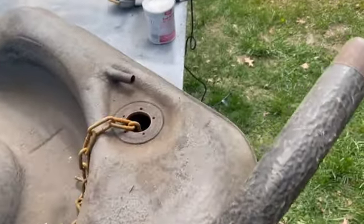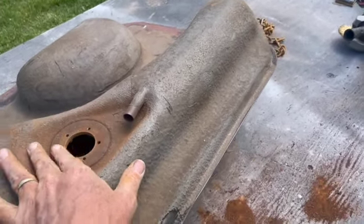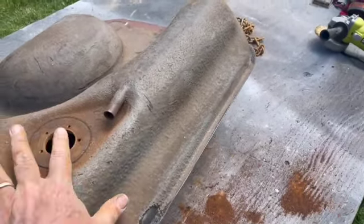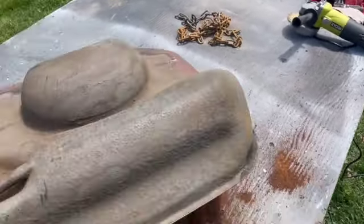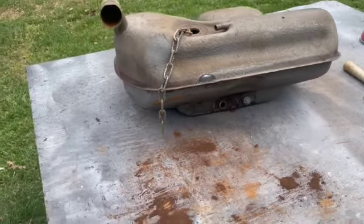We're not stopping every time, but this is the kind of stuff we're getting out. Using the vacuum cleaner too — trying to break up and get all that loose material out. I know a lot of you are thinking why not just use the power washer, but it takes forever for them to dry. I want to get the scale, get all the loose stuff on the inner walls knocked off first before we ever start rinsing. Whether we use CLR or muriatic acid, we'll pre-treat and wash all the walls, then rinse, and give the tank a couple of nice hot days out in the sun to dry. That's where we're at — restoring tanks today.